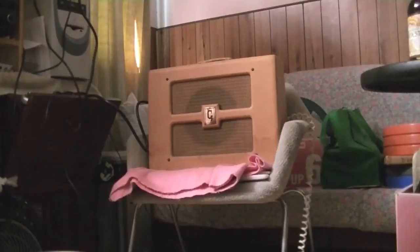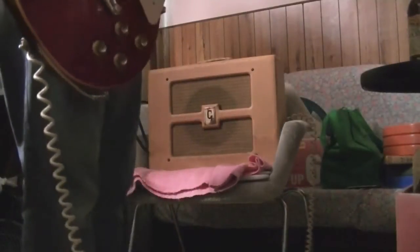One thing I will mention before I play: there is no negative feedback. What does that mean? It doesn't feed part of the output back into the input 180 degrees out of phase to keep it clean. So beyond a certain point you actually get distortion, which is a really good thing - it's what you want. This is why you play a valve amp in the first place. Anyway, this thing should be warm by now so I'm going to turn it up to about nine o'clock and strum away on the bridge pickup.